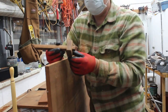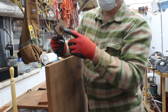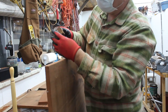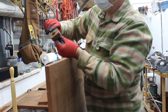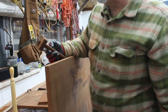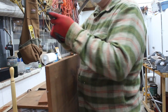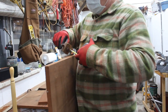This is my dad's tool — one of his marking gauges. It's got an inch scale here and there's a little steel pin right under my finger, a little wooden screw, and it's adjustable. The steel pin is right at the zero mark, so I need about an eighth of an inch. I'll put the block at about the eighth-inch mark. It's a very old printing with speckles of paint on it, so it's a challenge to read, but it seems pretty close. I'll check it against my modern scale — it's pretty close, just needs a smidge more.